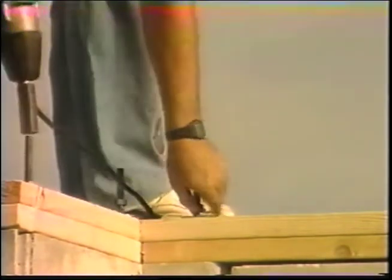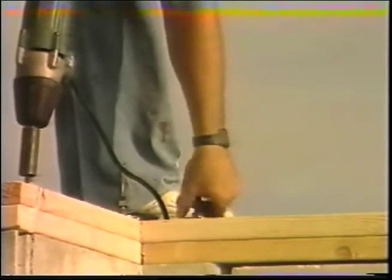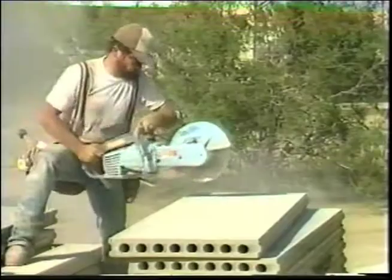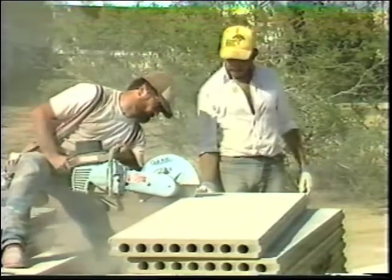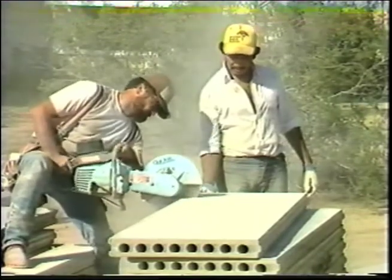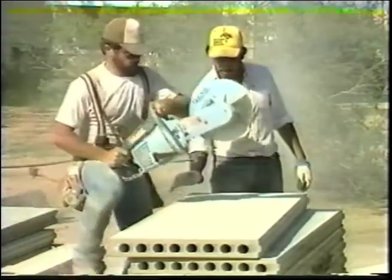Other panels are then placed in the 2x4 channel and threaded rebar is pushed through the hole in the panel and fastened to the coupling in the foundation. The upper two wood plates are attached to the rebar through the top of the panel with a washer and nut. This is done on all exterior walls. The saw used for cutting panels was a basic 14-inch gas-powered concrete saw with a carbide tip blade. Only two blades were used for all panel cuts of the total 141 fiber panels. Safety glasses and a dust mask should be worn by the cutting crew workers.